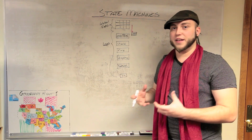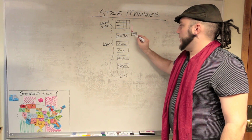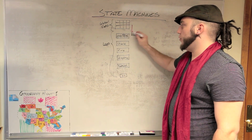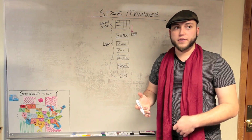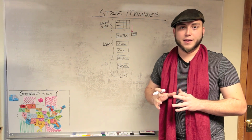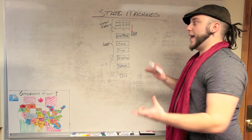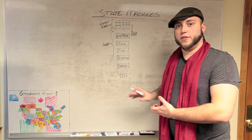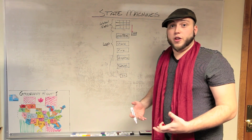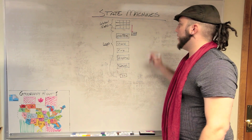There's not any really fancy programming going on there, except for the fact that I have this box here, and I'm calling that the latch. And grab position has access to a global variable that controls this latch. The weapon changing action, for instance. Once I've done that once, I want it to wait a few seconds before accepting that same action again. Otherwise, you tilt the thing to the side and it would just go crazy. And you can't just put a delay in a sketch like this. Delays are not your friend when you're talking about state machines. I really just need a way to divert the program flow away from that module for the next couple cycles until it comes back. So that's what the latch does.